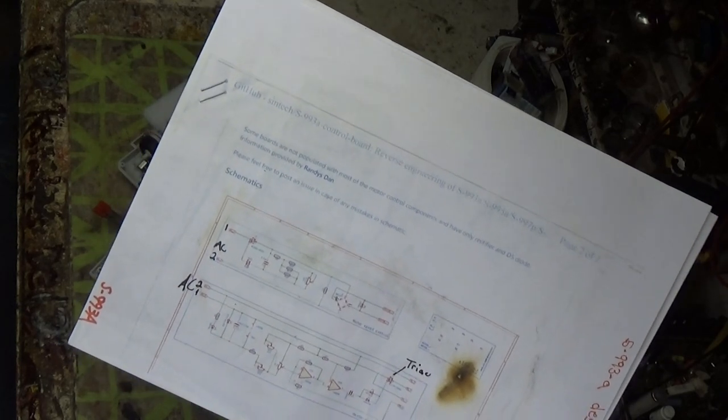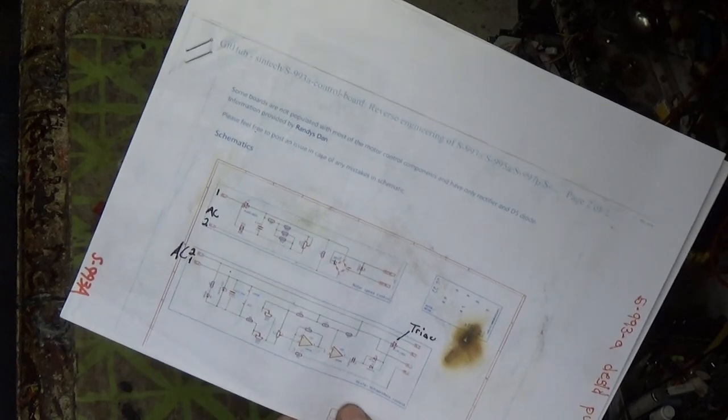Basically, what you got going on is this line right through here. This is your motor, your speed control for your pump, your pumping action. The AC down here coming through goes right to your heater element, which is heating up the solder, and then obviously the pump pumps it out. So I was hoping it was that, but I really wasn't sure.